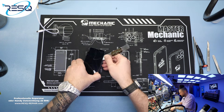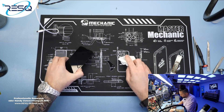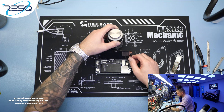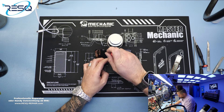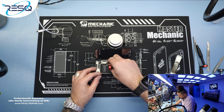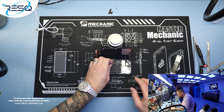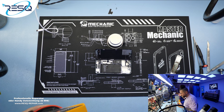I don't know if there is a short circuit on the board. I want to prevent anything like burnt-in traces, so I first open the device before I connect it to USB power and just check if we really have a short circuit or not. Perhaps it's only an issue with the screen or whatever — I don't know at this point.